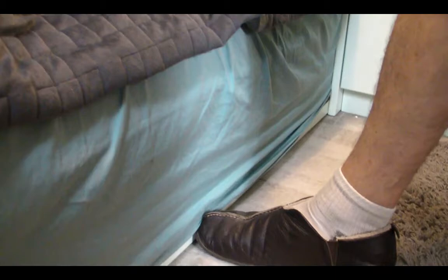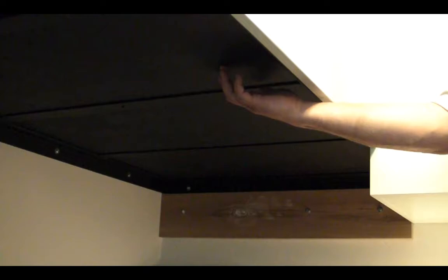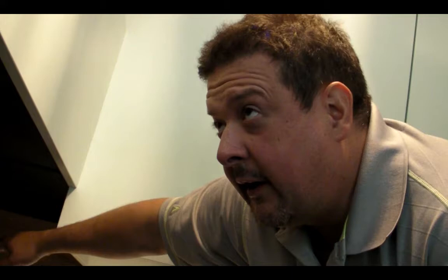Underneath here, this is just a simple double bed on a small wooden frame just to bring it an inch or so off the ground. It's made of six-quarter pine. Back here we have some wall-mounted power and a reading light. The underside of this bed is a metal frame made out of quarter-by-two angle iron perimeter, welded up with three-sixteenths by two-inch flat bar intermittently throughout, and then a plywood mounted to it. It's a bit captain over-buildy — it's lagged to the wall on all the studs. We have a ledger board over there because whoever built the house put horizontal members through that wall, so I had to put a ledger board to hold that end. This side of the bed is attached to this cabinet, and I'll show you more of that when we get upstairs.